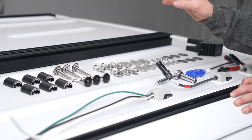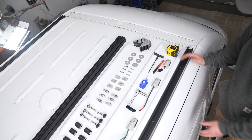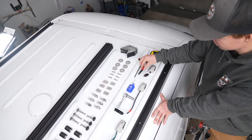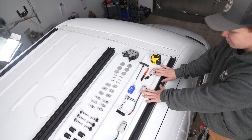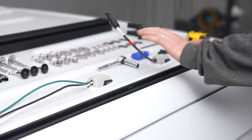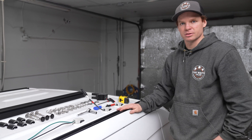We also have hardware for attaching the rail to the L feet and the solar panel to the rail. For tools you'll need a tape measure, a 5/32nd T-handle Allen key, a Sharpie, some Loctite, and a 7/16th socket. You'll also notice we've already installed our cable glands — positive and negative — which also came in the TinyWatts phase one kit. A third cable gland is here because this client will have an extra lighting feature. This van is pre-wired for solar and we're now ready to install our standard solar panel.